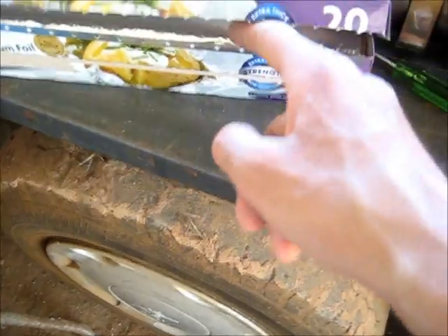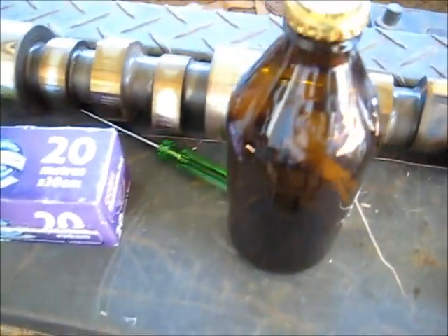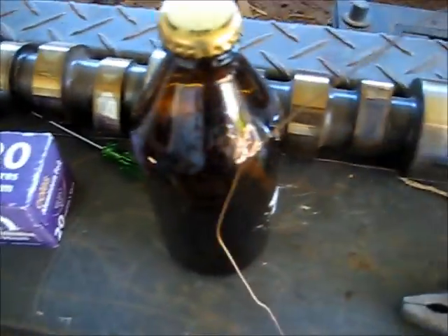So I'm going to wrap some wire around the outside. You have a wire on the outside, wrap the foil around the outside of the bottle, have an electrode going in through the lid, through the bottle, and you fill this up with salt water — and that's the electrolyte. That will act as a salt water capacitor for microwave transformer arcing — basically for high voltage projects. I'm going to give it a go.